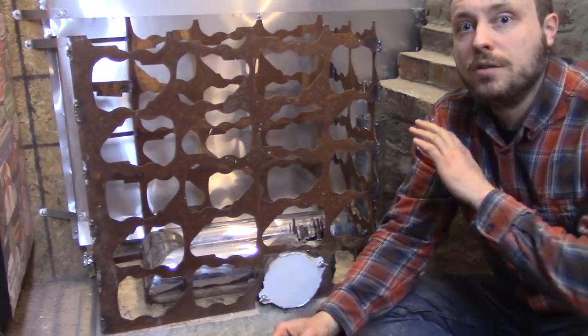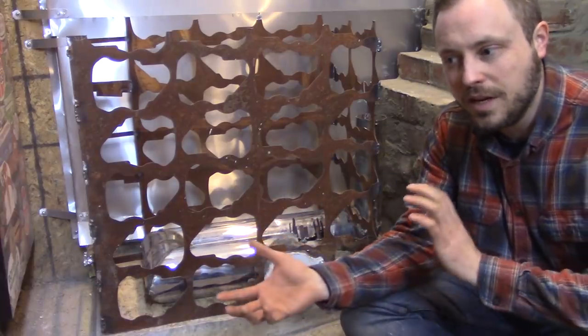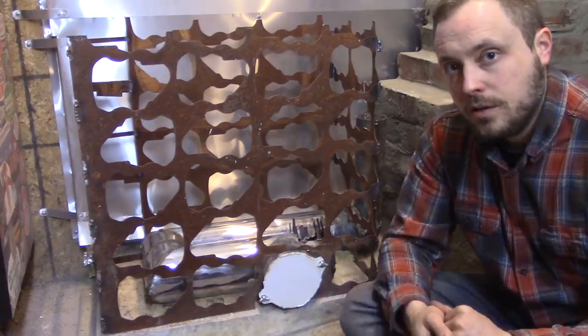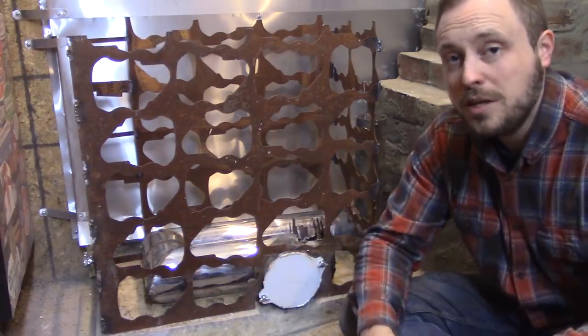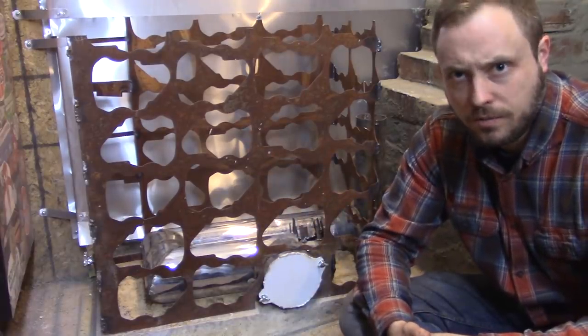People say don't ever put rocks in the fire because they'll explode. Well, if they're dry, they won't. But if they have been exposed to enough moisture, they can explode. And I didn't know if granite was one of those. So I looked it up to find out what makes the difference between rocks that can potentially pop from vapor pressure when they get hot versus rocks that don't and just release it.